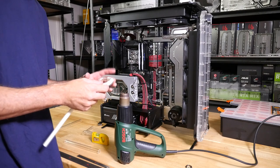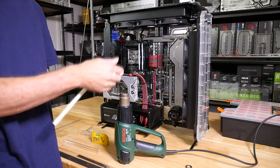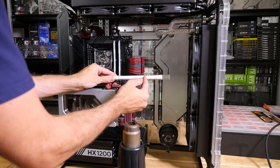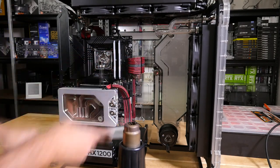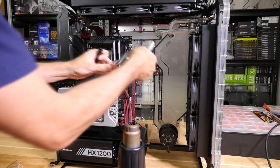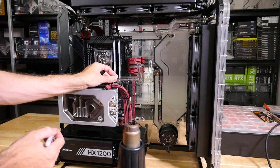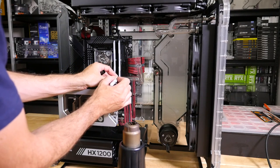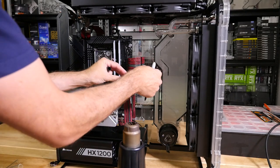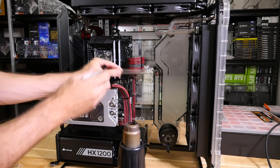If you see any bubbles, it means you've heated it too quickly, because you can get it really hot if you're patient — to the point where if you just let it go, it's going to bend on its own. That's really where you want it to be. So you start with a tube that is too long, put a bend in it, and leave overhang on both sides. Then you put the tube up into position, mark the overhang that you have, and go cut it. Usually what I do is creep back — I start about three to five millimetres over and give it a little bit more. Sometimes it can be hard to see exactly where you need to mark the line, so you just slowly cut off more and more until you get it exactly right.